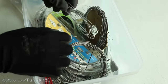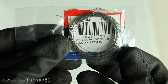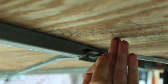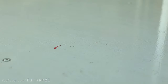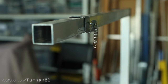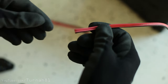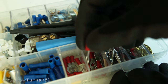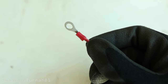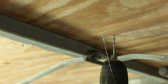In the old wire and cable box I have a spindle of nichrome wire. This stuff's pretty cheap — it's resistance wire, so it gets hot when current passes through it. It's made of a mix of chrome and nickel. Unspool a bit of this wire and thread it through the table hole, then twist the wire onto the loop of the spring. Take the figure-8 cable from earlier and split it into two separate wires. Grab a terminal, crimp it onto the end of the cable — or if you don't have terminals, strip the wire back further and twist it into a loop.